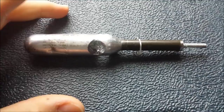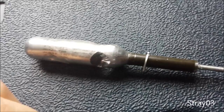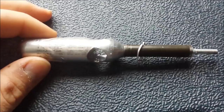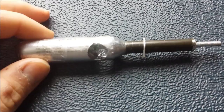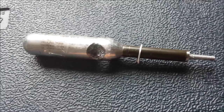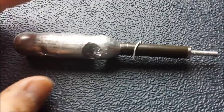It works off of an inertial firing pin which strikes a primer which ignites a smoke mix inside. The one I made is a CO2 canister - not ideal, it's a lot heavier than anything else I could have used, but I had it with me. It's a prototype, so I used this because I figured if it hits anything hard enough it's not going to collapse and there's more of a chance of the inertial firing pin working as it's supposed to. Apart from that, it adds about 5 inches to the total length of the arrow and weighs approximately 50-51 grams.